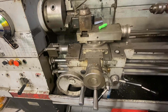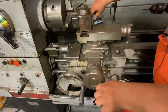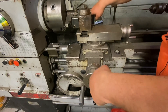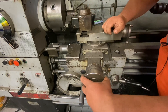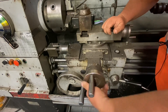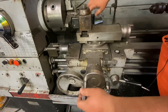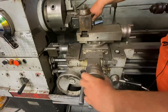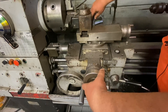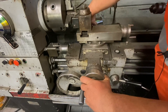Okay, this isn't going to be super exciting. What I like to do is turn it down and try to feel a little bit of resistance. I'll work the handle back and forth as I'm turning it — this is how I've always done it. Right now we're at about 70 thou of slop. So I'm just going to keep turning this a quarter turn at a time. I'm going to turn it in quite a bit because remember, I changed the set screw. Now I'm going to turn it in and feel a little bit of resistance on the screw.